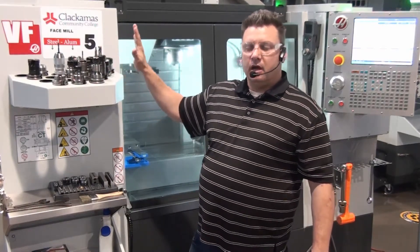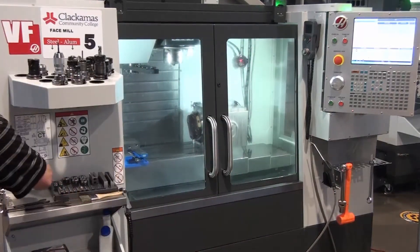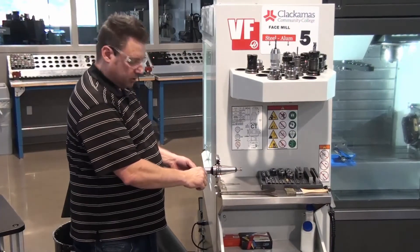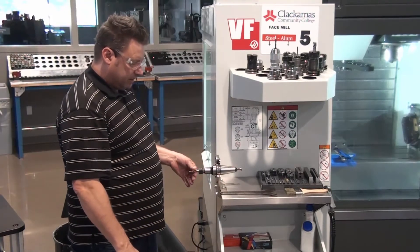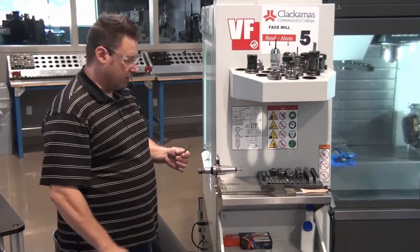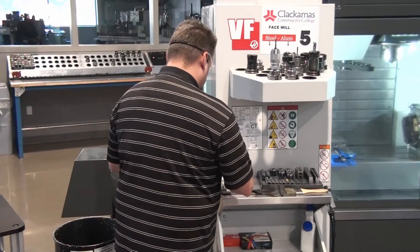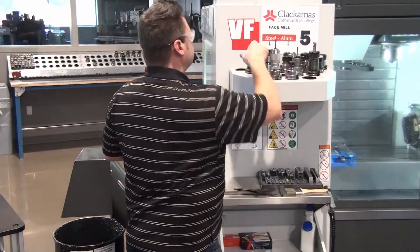If there's anything wrong with your tools, make sure you tell your instructor so that we can get the tools replaced. At this point you can go ahead and come over to the tool post and take your tools apart. To take your colleted tools apart, loosen up the nut on the collet holder — you'll feel it get tighter, and it'll actually pop the collet. Even if you loosen up the collet, it won't come out; you've got to pop the collet by loosening it up. Take all the tools you have and put them back where they belong, and make sure you clean all your tools and collets — put your collets and tools back where they belong. Everything should stay at the machine.